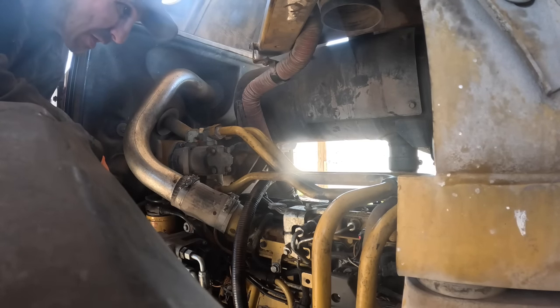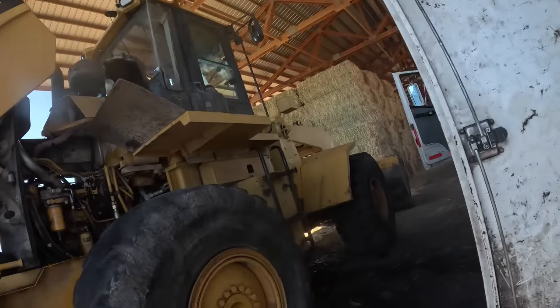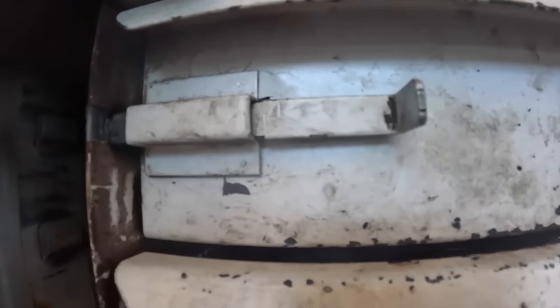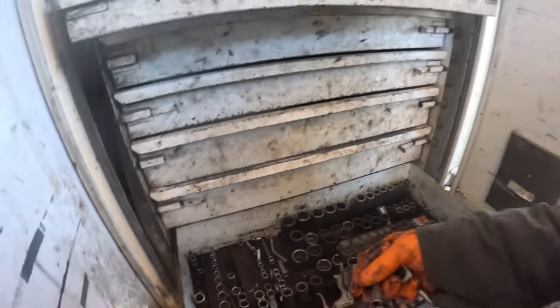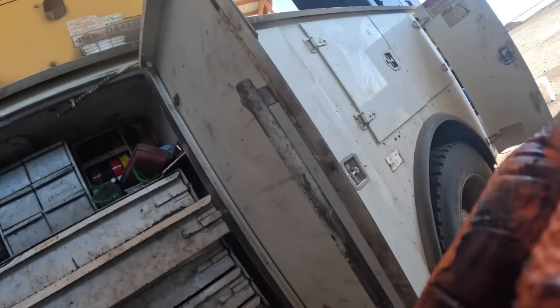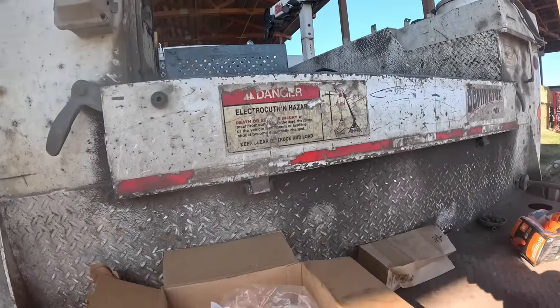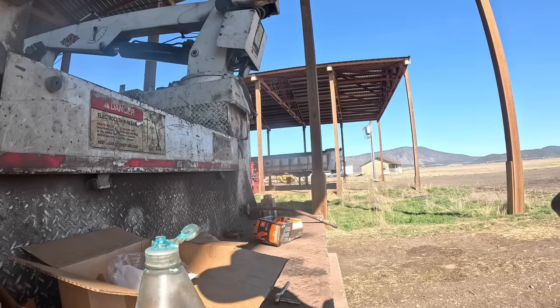After I replaced the relief valve, I got it running and it had a fuel knock at idle. I cut cylinders out one at a time and when I got to number six, the fuel knock went completely away. I had a suspicion it was number six, so I capped it off and it fired right up — just like nothing. I called the owner and of course, I know what everybody says — why don't you just change all six? I agree with that, but you do what the customer wants, and the customer wanted to only change one. So that's what we're doing.